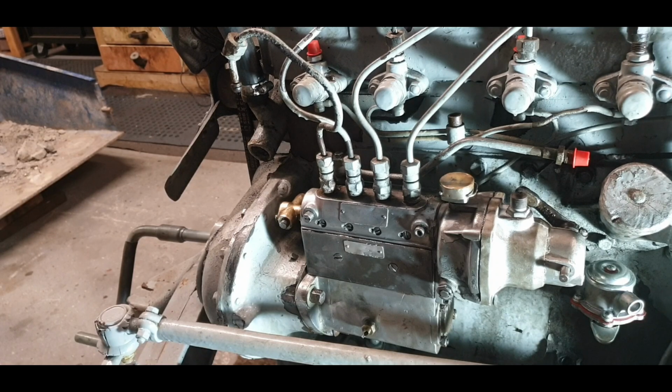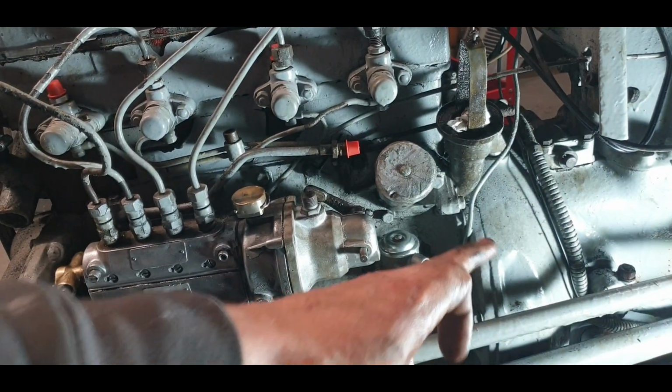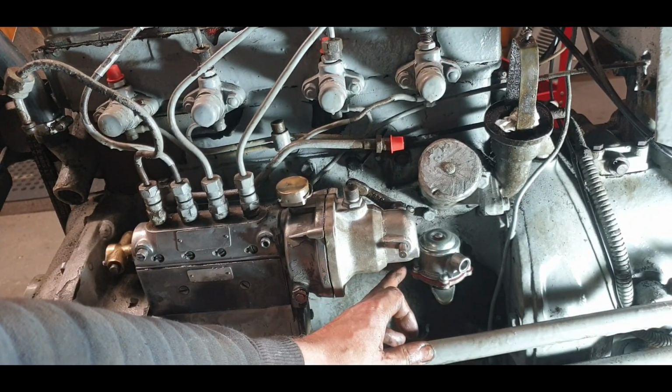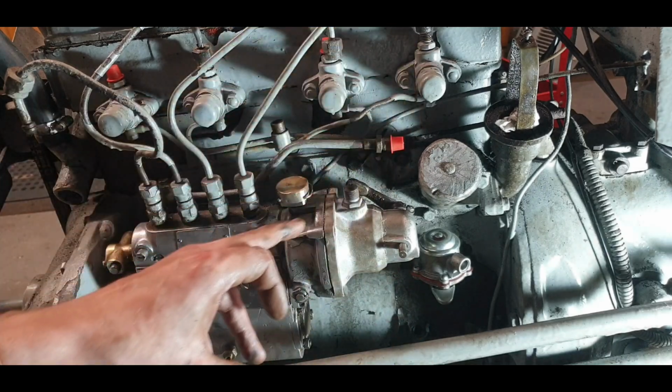But what we've got to do before then, we have to put on fuel supply, we have to put on our fuel filter, we have to hitch up our lift pump. It's a lot better to have a lift pump for spill timing because you can pressurize the system, whereas it's just gravity feed, it's a little bit harder.